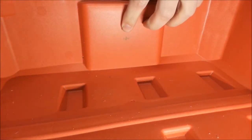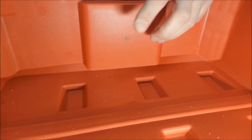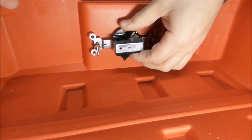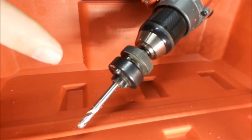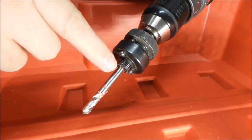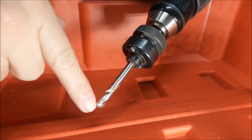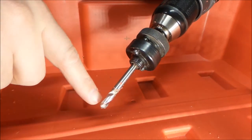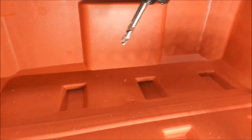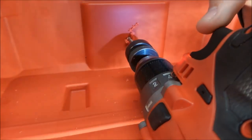We got a loose mark here on where center of this area is. Close enough for what we're doing. We're going to get a hole saw through this and get that mounted there. So a good trick when using hole saws is you can take the hole saw off the arbor and use your pilot bit to start the hole. A lot of times, sometimes when you break through with the pilot bit, the hole saw wants to grab right away and snap everything. So just take the hole saw off the arbor, start your hole. So there we go, we got our pilot hole.